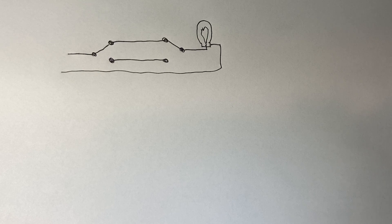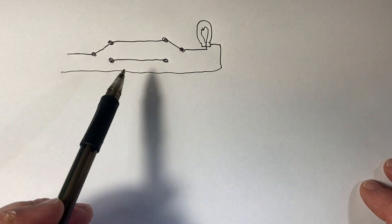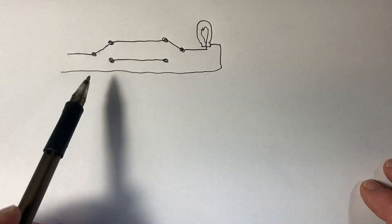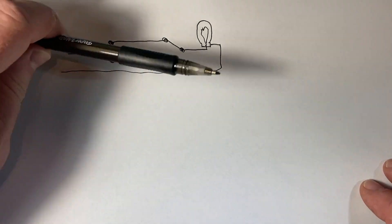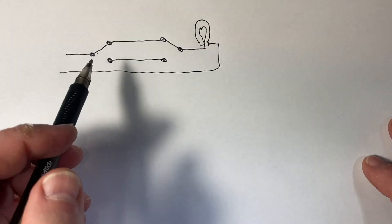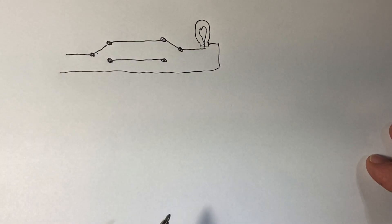Now hang on just a minute - I hope you'll indulge me. I finished this video and uploaded it to YouTube, but I really wanted to add an epilogue to explain a little better what we found that I don't think was clear in the live video. If you remember the picture I drew in her kitchen, this is the classic arrangement: one switch, the other switch, three screws, and it throws the power this way or that way. This is what we expected to find. Notice how the switches are beautifully symmetrical - they're kind of mirror images of each other.